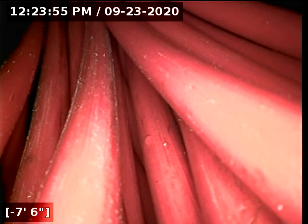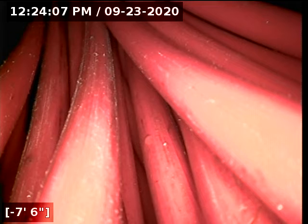So if repairs aren't done, I'd rescope the line about every year to keep an eye on things. And again, as long as people are just putting folded toilet paper down the line, a lot of those spots there are unlikely to cause problems, but lots of people ball their toilet paper up and put other things down the sewer line. So anyway, line is functioning, but it is draining slower than it should in a few areas, which is why I recommend those repairs. And if you do any repair work, make sure you do a rescope afterwards to check the work.